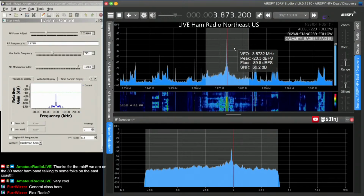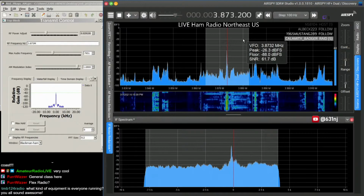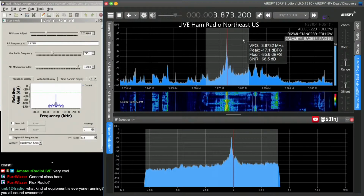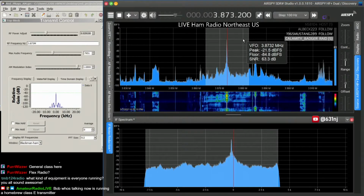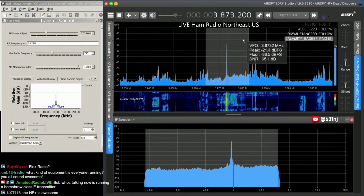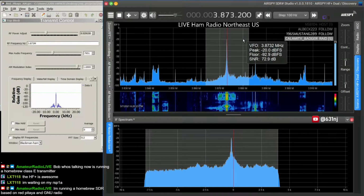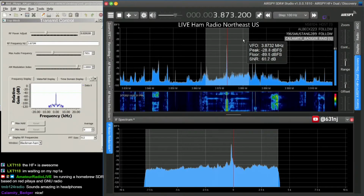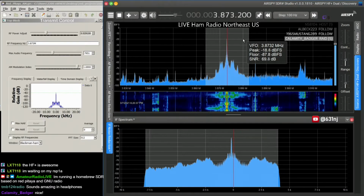I would talk to them for all kinds of RF problems. And I was listening to a guy one night. You know what? Let me try these. And all of a sudden, it popped up out of nowhere, which RF tends to do; it rears its head when you least expect it. You move a pencil on your desktop and you get RF. It started coming through my powered speaker here, and I put one on there and knocked it right out. I don't get anything in it now. So I used one on the guy's TV next door, and that eliminated me bothering him. So yeah, they seem to work pretty good. They're 31 mix. Anyway, just take a look at them. Ask Steve, he might even know about these.